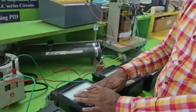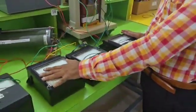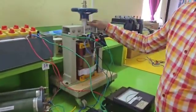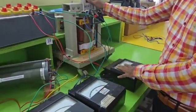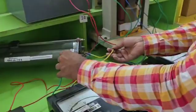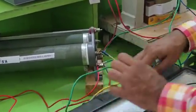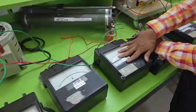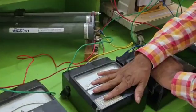Now coming to the voltmeters. There are three additional voltmeters. One voltmeter is connected in parallel to the rheostat and resistance. Another voltmeter is connected in parallel to the choke or inductor. The other voltmeter is connected in parallel to the capacitor. You can see the blue, green, and yellow wires. Green is connected to the starting of the rheostat and yellow is connected to the ending of the rheostat — these two are connected in parallel. In parallel, voltage is the same, so we can find how much voltage is across the resistance.